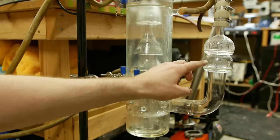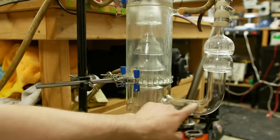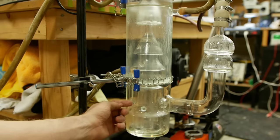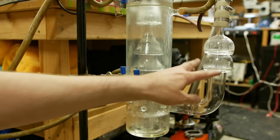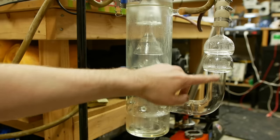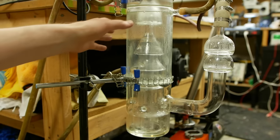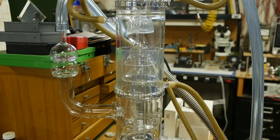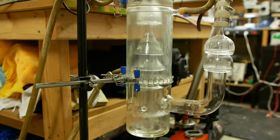The pump also has these two things which are oil traps. The idea is if there's a little bit of oil vapor that makes it this way and hasn't cooled off by the time it gets out here — again this is optically opaque — a gas molecule traveling this way has to contact the glass at these low pressures. It does manage to catch a little bit more oil before it makes it out of the pump. I should also point out that this whole section of the pump is water jacketed — there are actually two layers of glass here with water constantly flowing through. The amount of heat going into this thing is massive, so the amount of cooling also has to be massive to keep this thing from melting down.